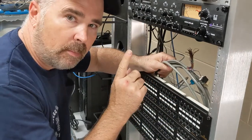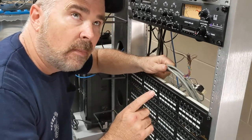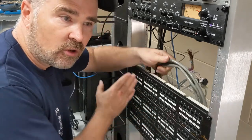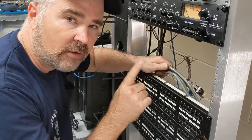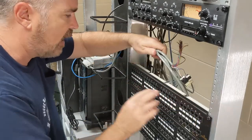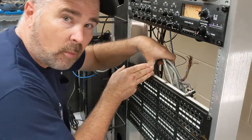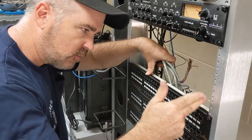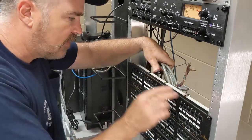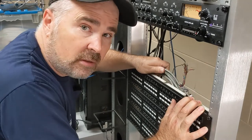There is a little bit of good news. If you look up the BCM50 wiring diagram, you'll notice that the red-brown pair is not used. So even though you need all 25 connections, that middle one — the red-brown — does not need to be used. You can just leave that out.